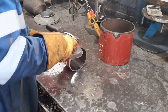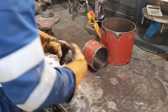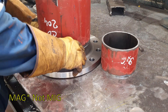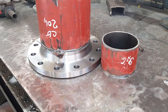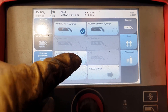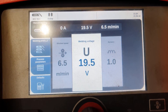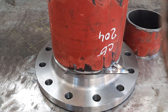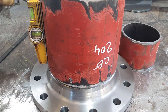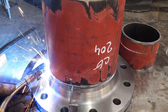Before I start any of my jobs, the first thing I always do is clean all the paint off the pipes. MIG isn't good at going through paint. I've got my 8-inch flange on the table, put my 3mm spacer on it, and then just put a single tack — matching the pipe to the flange. Nice and easy.